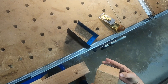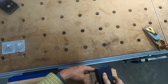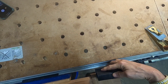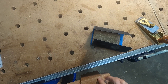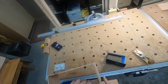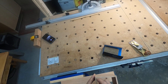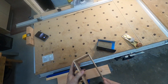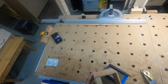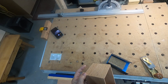All right, that feels good. Let me go up on this side - looks like we lost a little bit of grain right there. Oak is a difficult wood to work with; it's so hard and so porous. I'm going to round off the corners just a tad. I'm going to have to put some filler for that little piece of lost wood, but you can't even tell it was misaligned unless you look at it from this point right here. I'm not sure how I'm going to handle that part - once the bottom shows up there it'll be a slight little gap you'll be able to see. Maybe I'll just put wood filler in it and leave it alone since it'll be on the bottom.